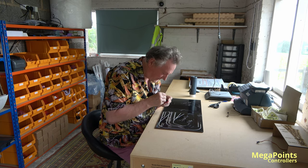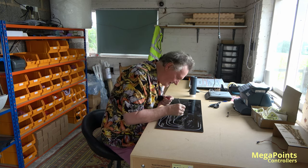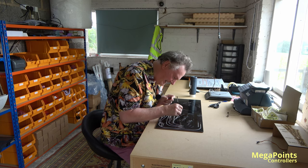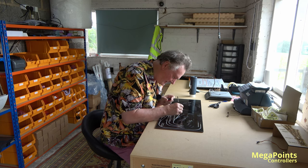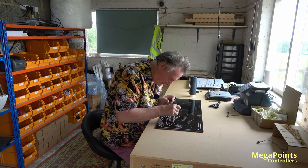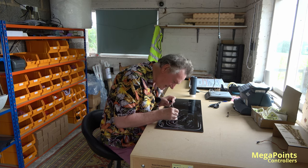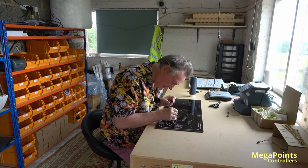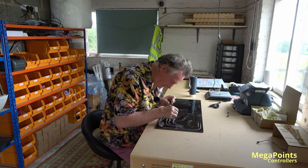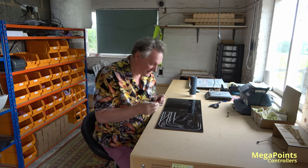And when I go for someone else's switches and lights, i.e. non-standard, it throws all my calculations out a bit, because for my stuff I've got the macros in the drawing software ready. And I know I can do a calculation fairly quickly and know what will and won't fit. But I can't apply the same calculation to this, so I usually eat up more space using these switches. And the only way I can reduce space is to not fit the switches. It's always the switches that take the space. LEDs, poke them through. Except these are so big.